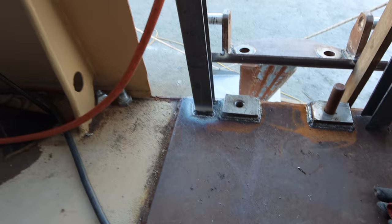My job now is to get out on the side of the boat and weld that slider in. So we're going to weld it fully around the bottom, get it in there so that it's not going to move anymore, and then we'll start tacking in the 12 mil thick, or the half inch 12.75 half inch vertical stabilizer. So just done an amazing weld.